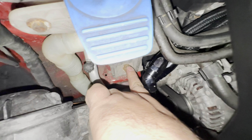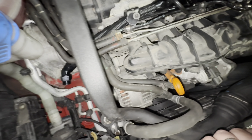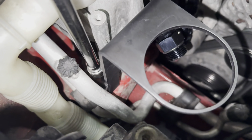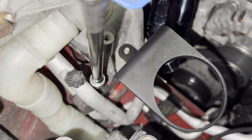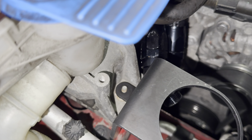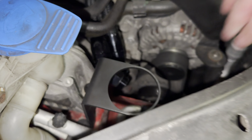Now we're going to go a little bit tighter. That's it — you don't want to go too much. This torque spec is like 30 inch pounds, I think, so it's like nothing. Alright, that's on there. This O-ring is just not wanting to get out there. So the O-rings on here — be careful because they will bulge. They do not want to go in too easy, so I recommend oil it up pretty good. Always take your time. If something's not going in right, don't force it — you will ruin something.